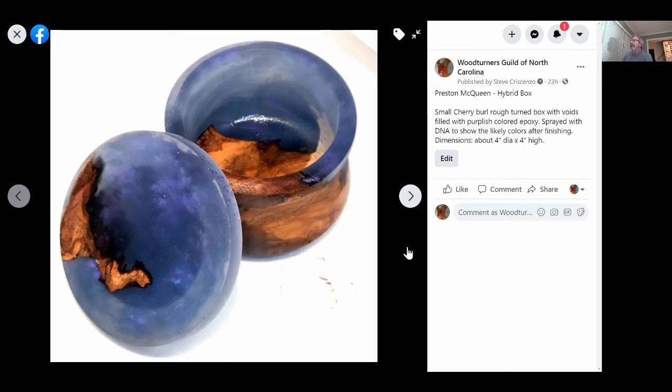If you seal when it's almost finished turning, but before you start, you can sand it down to about 400 with dry sanding, but you're going to want to wet sand the epoxy. So what I do is I pull it off and put a couple of coats of Seal-A-Cell on there to get the wood sealed, so when you go to wet sanding, all that water doesn't get into your wood and discolor it. I find that works very well.